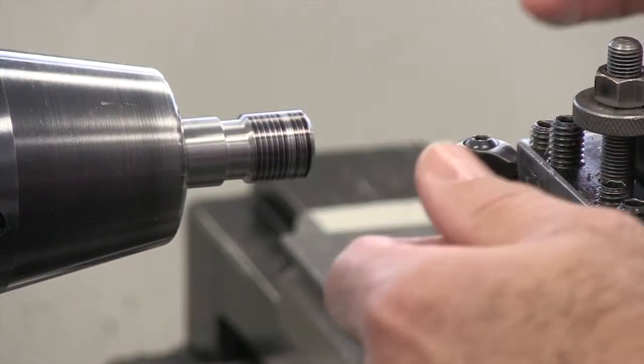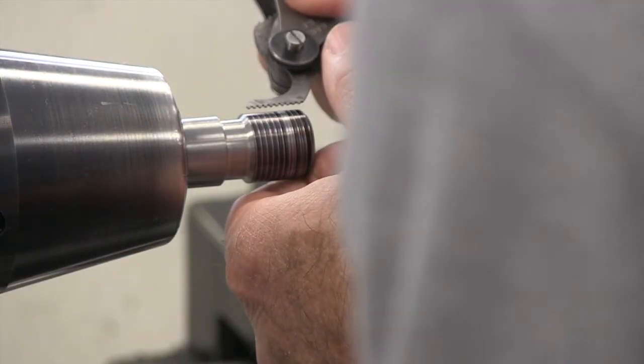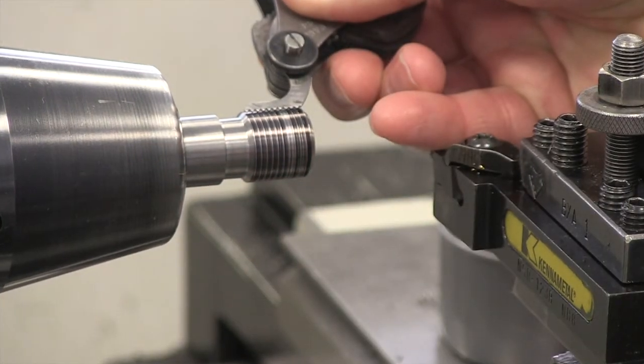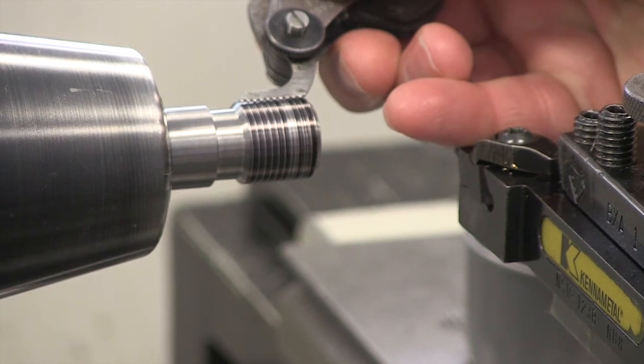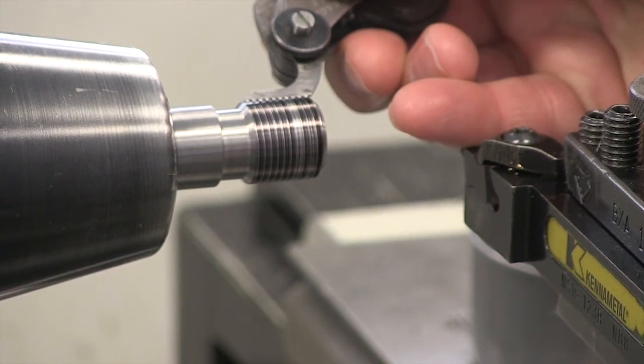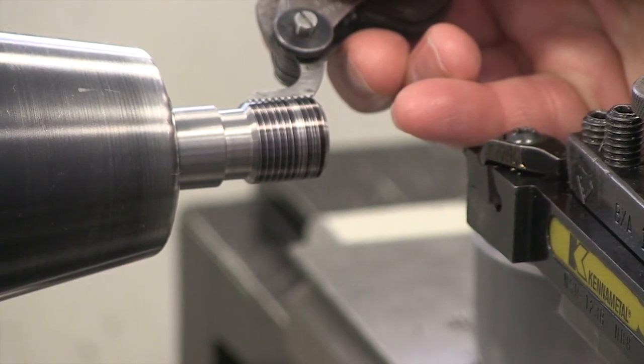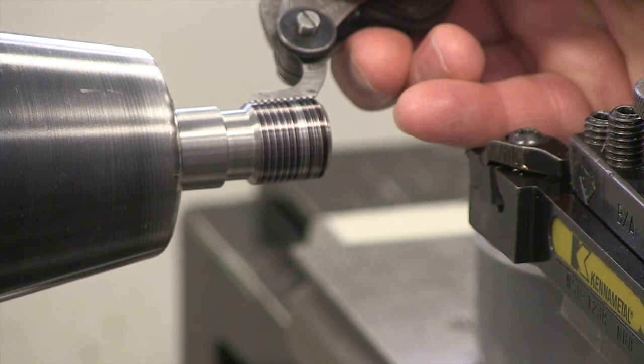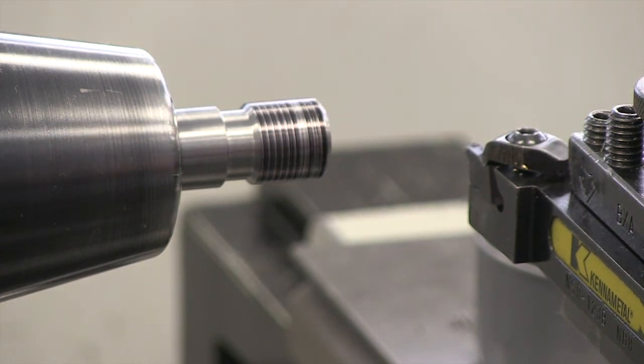Here I have selected the number 16 thread gauge. I'm going to set this in, and you may be able to see that it lines up right in the middle of the little V's, which would represent 16 threads per inch. I can also, in this particular thread, knowing that a sixteenth of an inch is 62.5 thousandths, measure from one line to the next and verify that we do indeed have the right gearbox setting.